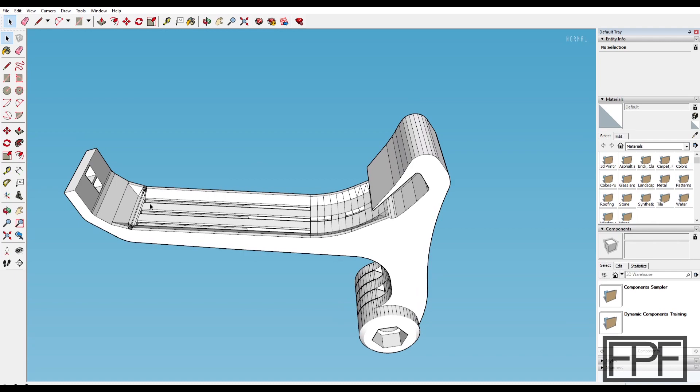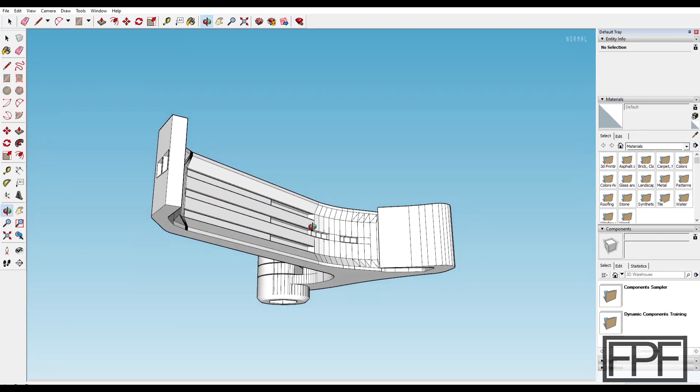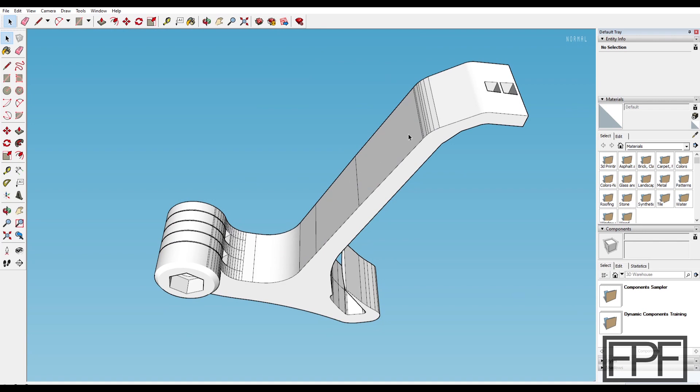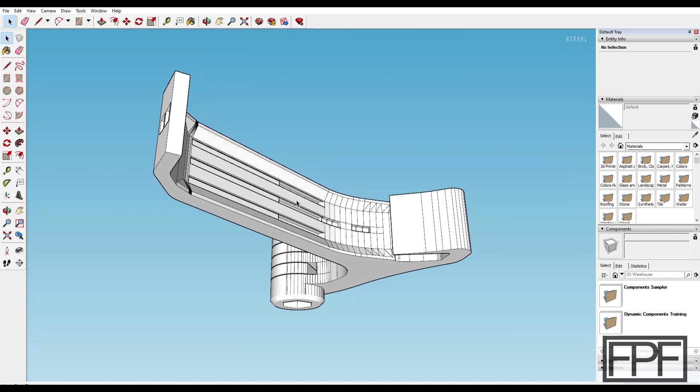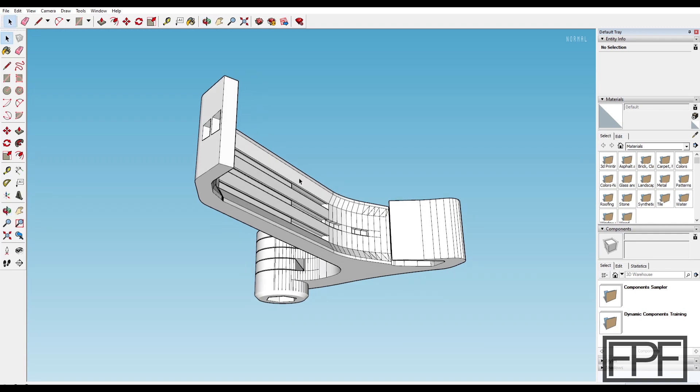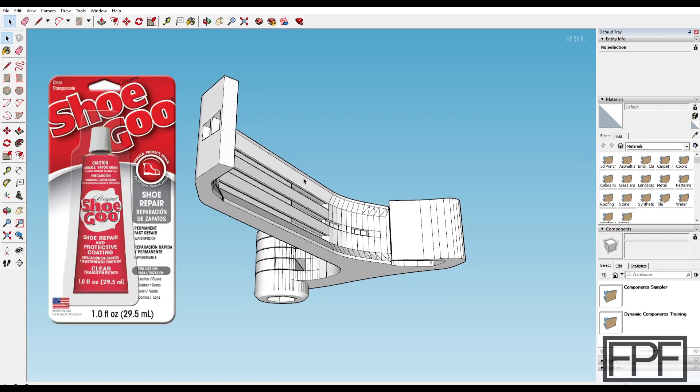One thing I left out when talking about the design — you notice all these shapes on the inside. These are not for show; you don't see these once it's in place. Everything here is just for glue to get into all these grooves and lock it in place. The chin bar locks it pretty well and the vent keys it into position. I use a glue called Shoe Goo, which I'll also link below — it works really great for most 3D printed plastics. I print this in PETG, as well as whatever material the outer casing of the helmet is made from. With enough force you can get it to come off and just peel the glue off with your fingernail, but it does a great job locking it in place.